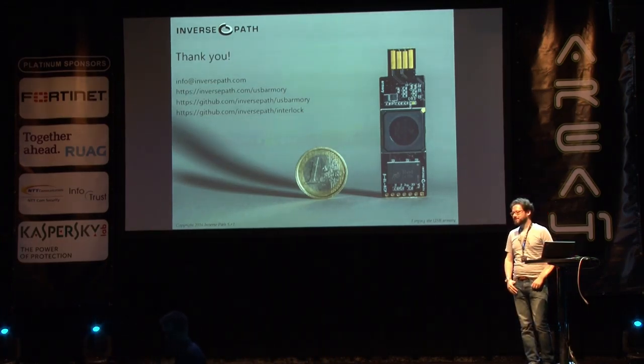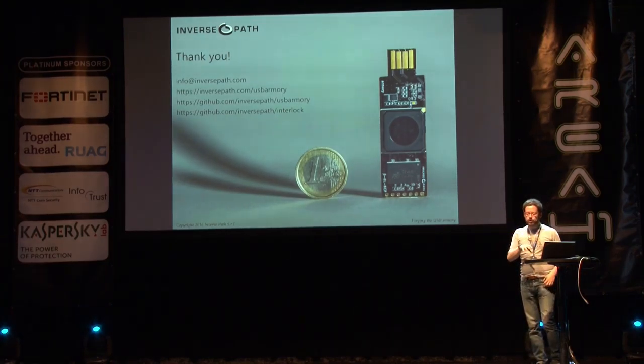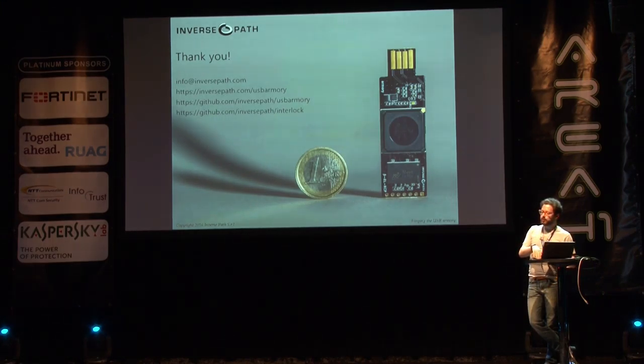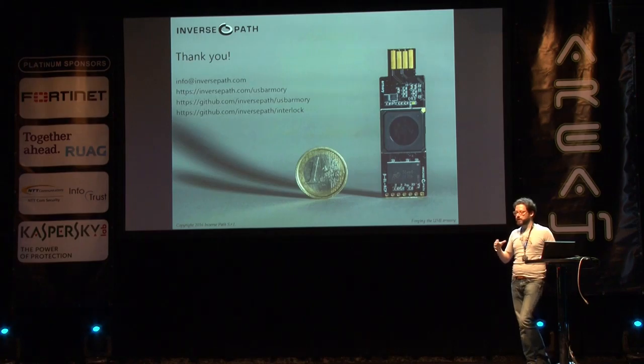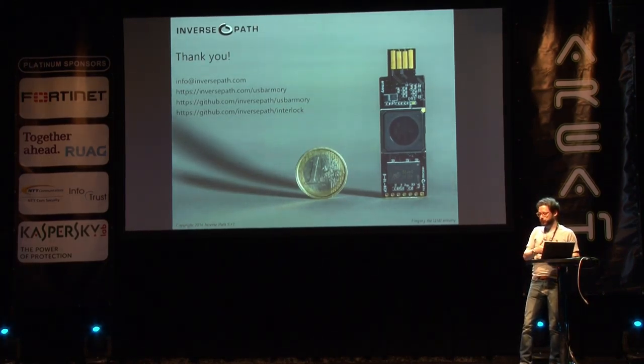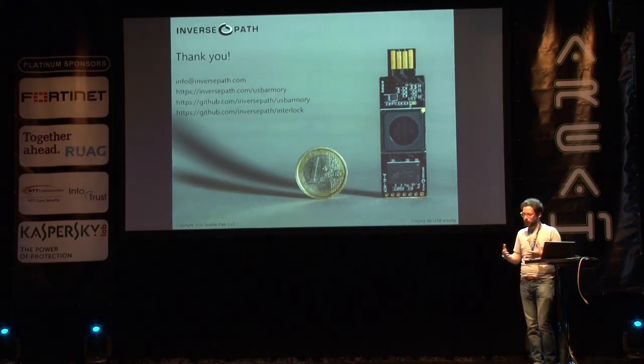Yeah. Hi, thanks for the talk. Is there a possibility to load the PGP key in the secure enclave? So how do you protect the key material? Right. So there is no persistence on the device other than the few secure boot keys. And there's a symmetric unique key per SOC, which cannot be read, which is embedded in the system on a chip. The model for securing user data is that you don't want to be too tied on the hardware features for doing that. So you want to keep all of those data on an encrypted partition, ideally, or on encrypted firmware.